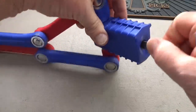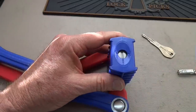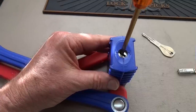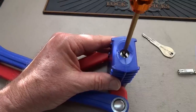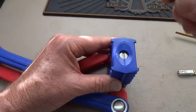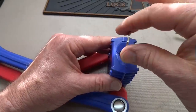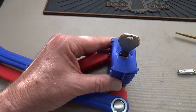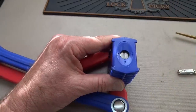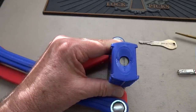Before we think about exploiting it, let me talk about my experiences in picking this lock. I spent about two and a half hours trying to pick it. First of all, the core is free-floating — it's non-tension. And it just freely rotates. As a consequence of that, you can't tension any of those wafers; they're free-floating. The way I view it is when you put the key in, it positions those wafers, and then you'll be able to turn it. If you begin turning the core without them being in alignment, you won't be able to get into the lock. There's absolutely no feedback from the lock whatsoever, and I just can't imagine you'd be lucky enough to rake all nine of those wafers into the right position.